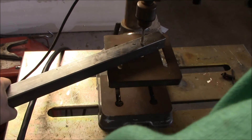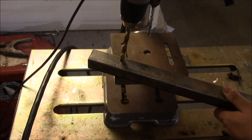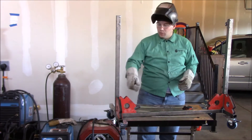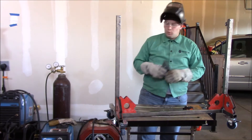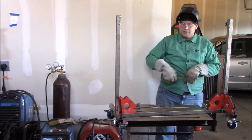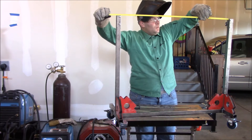I've cut two uprights 36 inches long and I'm drilling a quarter-inch hole in each to mount my bearings, then countersinking the hole with a slightly larger drill bit. Now I'm going to bolt my bearings on with those quarter-inch bolts. I have my two uprights set in place with squaring magnets — two at each joint — but I still like to double-check with my square. All you need is a little piece of material stuck to the magnet and that will throw you off.